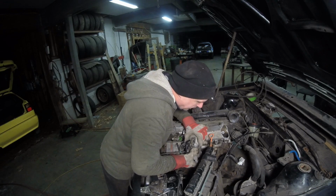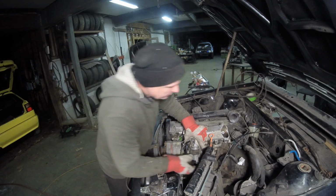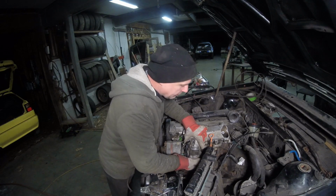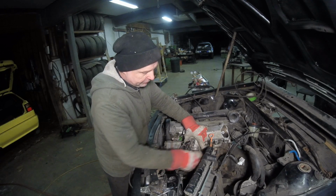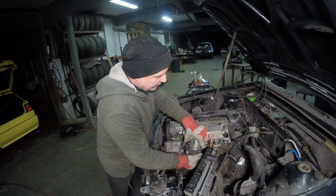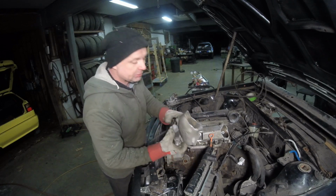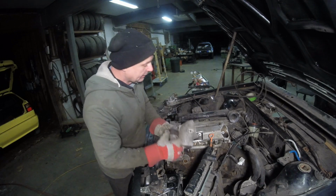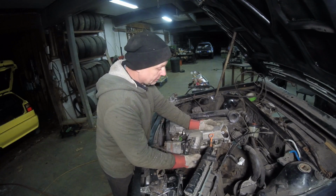Well, that's got to be the final position right there. It's missing everything. Gives us the clearance for an extra little bit of radiator. At the very worst, we'd have to move this thing out a little bit, but that's nothing. It's easily movable. And I have to take the flap wheel and clean this up. What I did was I basically just fish mouthed everything and just went down millimeters at a time. That's all I did.